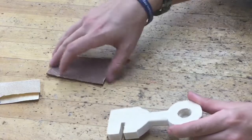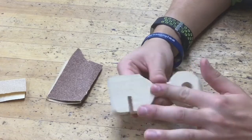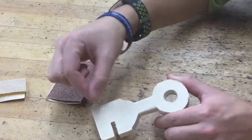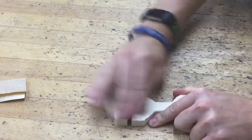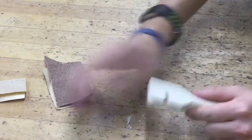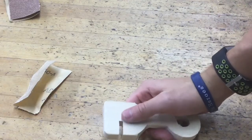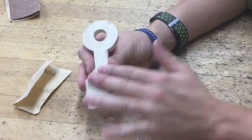And one tip I'd like to give for you guys for when you're working on your projects and sanding, sand in circles. If you take a look at the wood, some of it might feel like it's furry or fuzzy. All these little wood fibers are sticking up. If you go in a circle, it forces them back and forth, and eventually they will break off.